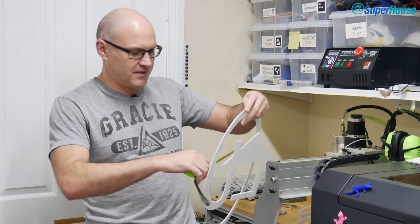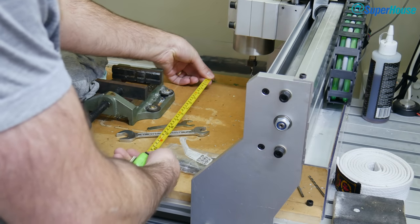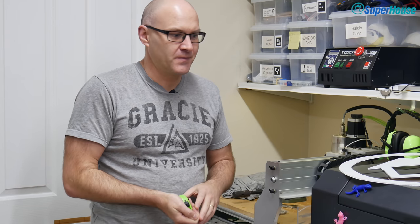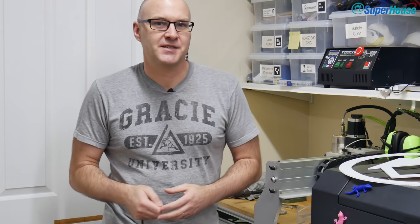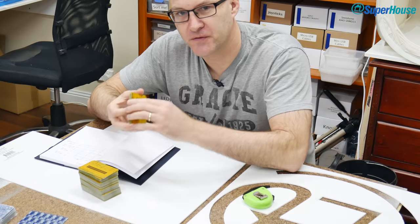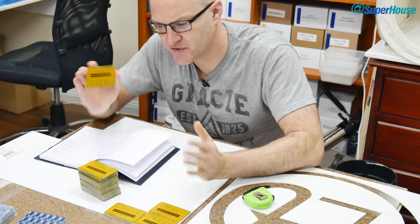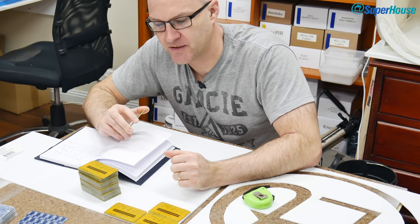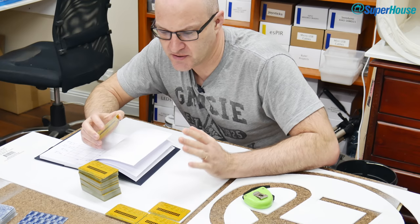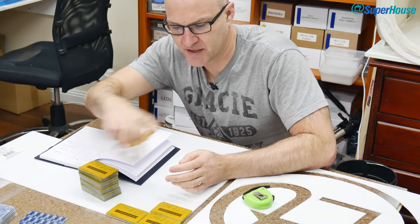This logo ends up being a bit too big — about 460mm across. What I can fit on the machine and still reach with the head is probably more like 370mm from side to side. So I'm going to have to scale the logo down a bit. After almost an entire minute of gruelling calculations, I figured out that if I use 40 of these particular PCBs and make a grid of 5 by 8, I'll have a solid base just small enough to fit inside the CNC machine. I'm also going to use core flute as part of the waste board so I can cut partway into it.